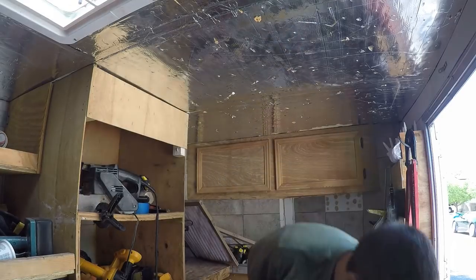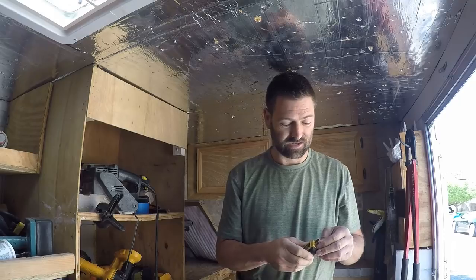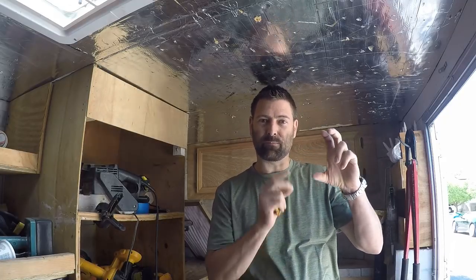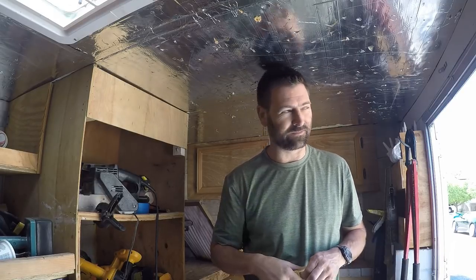This could be another one of those jobs — I just had one yesterday, it was $500 for about 15 minutes of work. I'm going to get my outlet tester. What's funny is the property manager and the husband have taken the outlet apart in the garage — completely unnecessary. I think all I've got to do is push a button, collect $500, and move on. This should be common knowledge: what GFI outlets are and how they work. It's not just the one with the buttons that's protected — there's a whole series protected from that one outlet. Let's go put this outlet back together, test the one in the back patio, and first stop is the master bathroom.